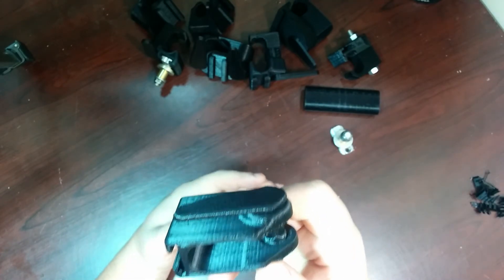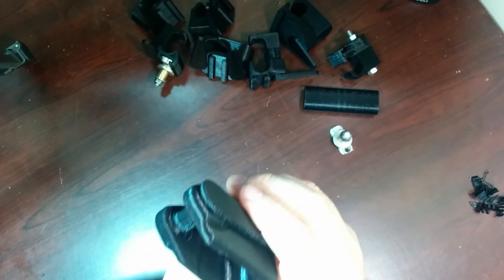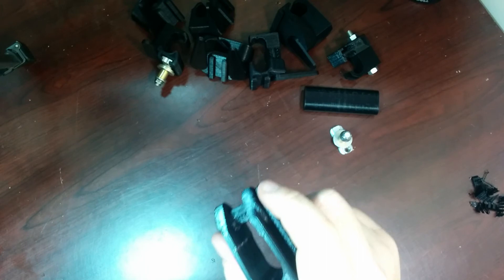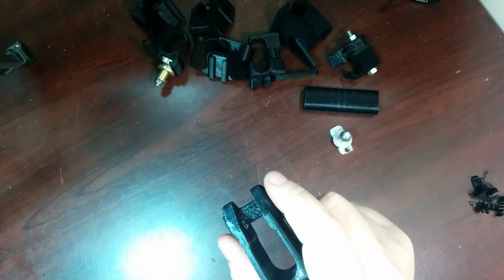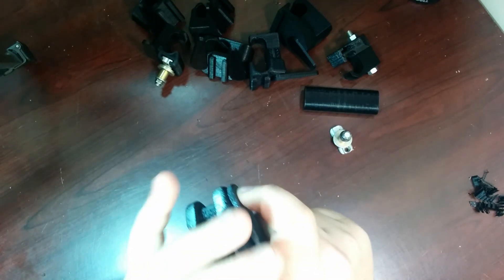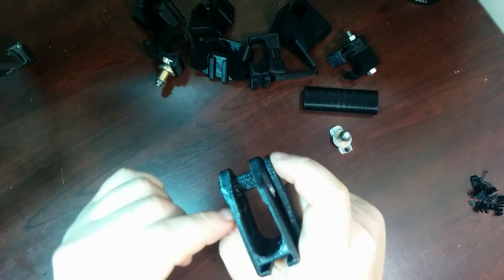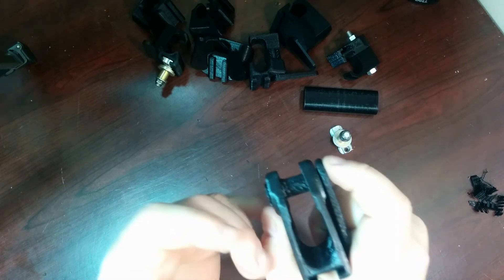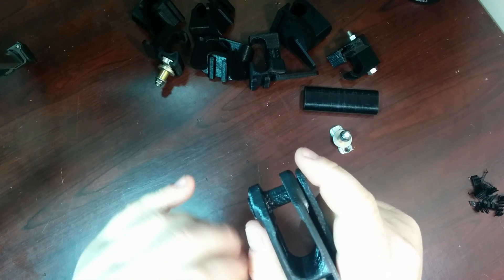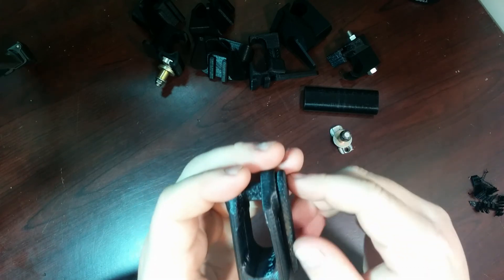Also, something I learned with printing this: infill. If you guys are printing anything, try to turn your infill off or increase the amount of shell layers. The shell layers give you strength in that one direction, whereas infill just fills space. No matter how much infill you put in, it's still not attached to the outside. When you're printing anything, turn your shell value all the way up so it can print continuous strands inside — it will give you the most amount of strength.